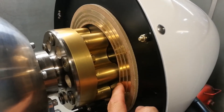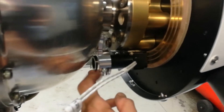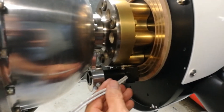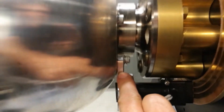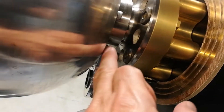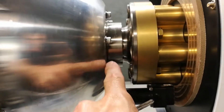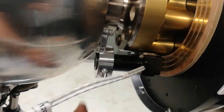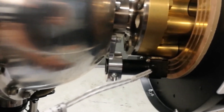You've got your three slip rings on the back there which set your DC reversing and limits. They've got a really nice brush box mounted on a pole, and it's much longer than you need so you can just slide it up and down on that clamp and lock it in where you like. Airmaster were kind enough to design this for the customer so it picked up two of these seal carrier bolts, which was really convenient. I could work through the lightning holes to get to those two screws, placed at the bottom for aesthetic reasons. You just cut that tube off - mark it out, do a dummy run, mark it and cut it off - and I came up on it slowly so as not to spoil it.